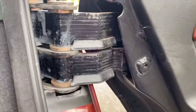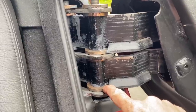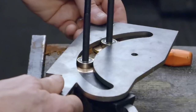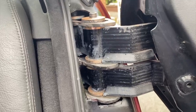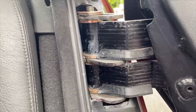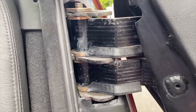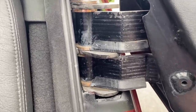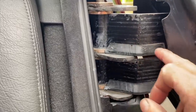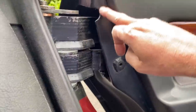Looking at the rear door mechanism, it looks like they've laser cut multiple plates to stack them up rather than have one machined plate. They've inserted bushes — I'd expect something like phosphor bronze — so it work hardens. The door slides in and out on these bushes. What that means is the more you move it, the harder the material becomes and it doesn't wear down as much, which is the last thing Darren needs after a year or two of use. There are also nice little 3D printed dirt scrapers to stop the door jamming — very nice little detail.